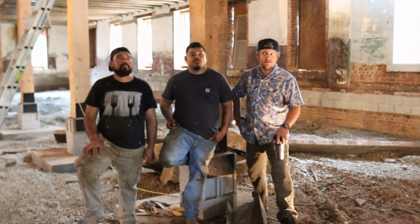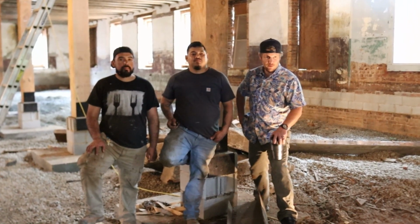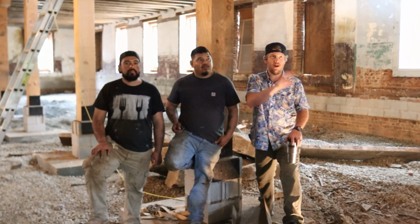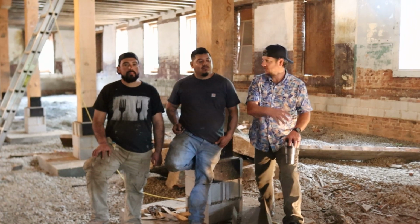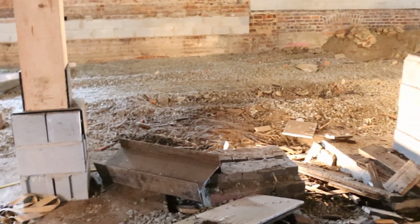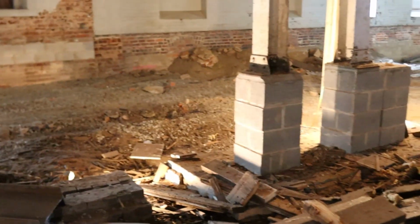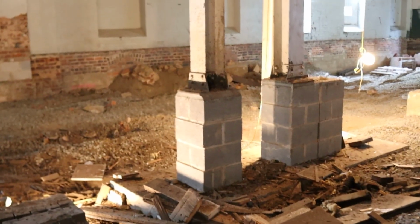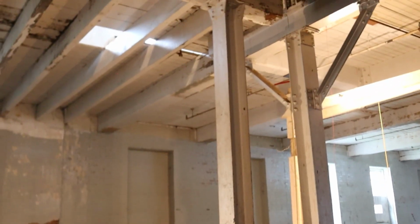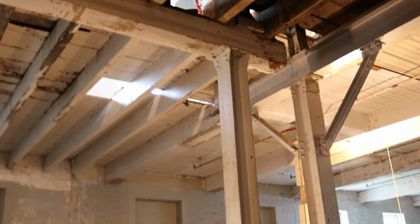We're downstairs and we can't really move around too much because it's dark and the camera won't be able to see us if we move. We finally got the last jacks off of column 7 and 8. So Arturo built the last footing, blocked it up, and we wanted to let it set up. It takes 7 days technically to get a good amount of structural integrity in the concrete that we poured. And then we were able to take the last jacks down, the double steel I-beam that was up there, all that craziness that was holding this building up in this one spot was done.